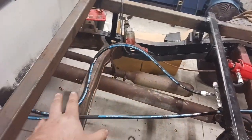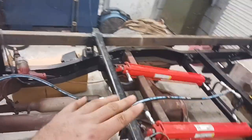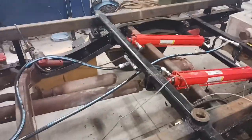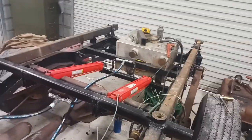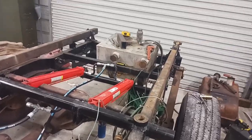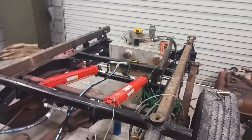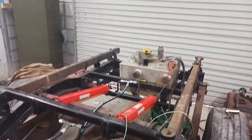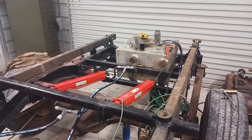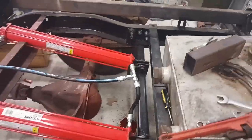I think we're going to end up having to have another piece of hose made here — I didn't really calculate in movement, so dummy me. I got those back fittings cracked, which should bleed up. We're going to hit the button on the pump and try to bleed a little air out of those lines, then we'll tighten them up and see if it lives. Okay — we got fluid. I'm going to tighten these up real quick.